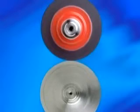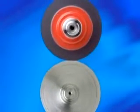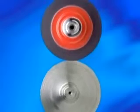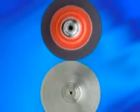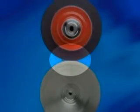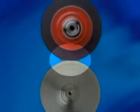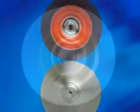If you have a roller recovered just once, there is a 20% chance that it is no longer concentric. The odds multiply each time that roller is recovered. What does this mean for the performance of your press? Defective, non-concentric rollers are the underlying cause of many of the problems that create so much frustration for a printer. If you've ever spent the afternoon chasing dry-ups, you will know exactly what we're talking about.